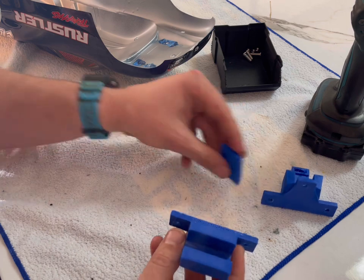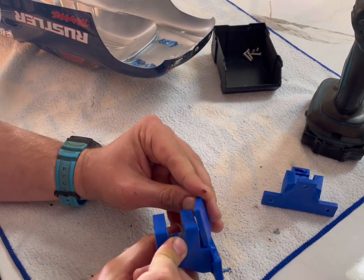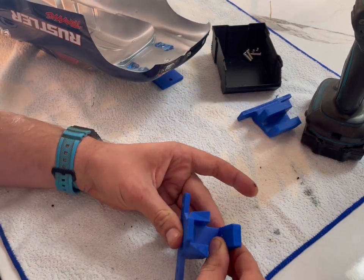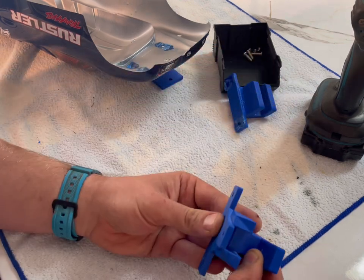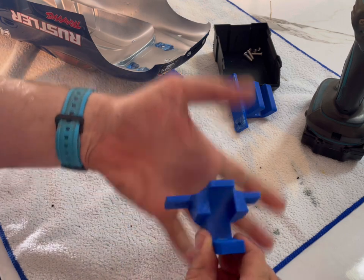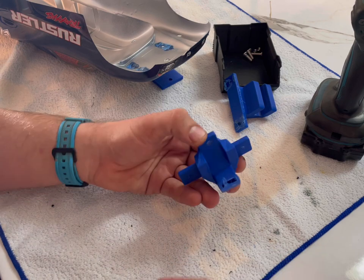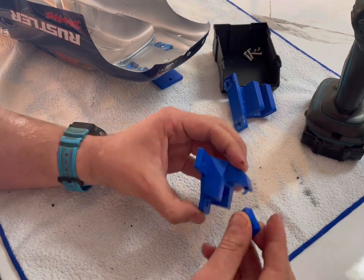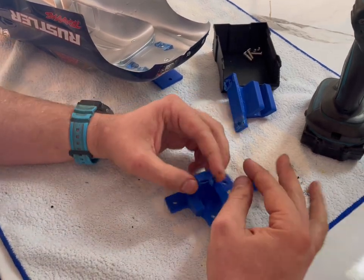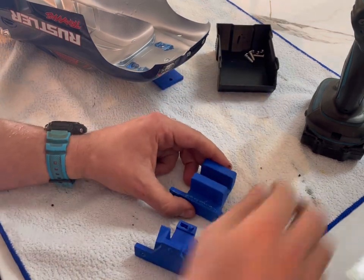This is version one of my Rustler clamp. It snapped off there — there wasn't enough material, it was quite thin. So then I made this one, and instead of just two sides I tried to make it easier. This part here would hook in more easily, but it was still a problem — this part here is weak, and the main issue is they keep breaking like this because I print them upright.